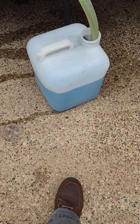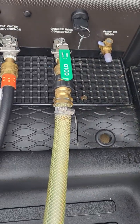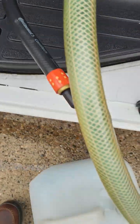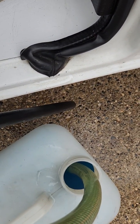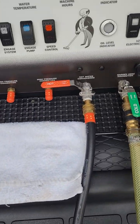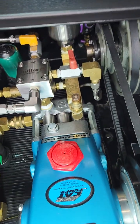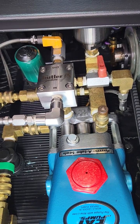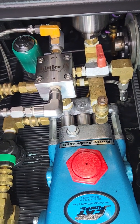I've got almost five gallons of windshield washer fluid here. I've got my hose coming out going to the garden hose inlet, and then with the hot water convenience valve coming out and laying alongside the jug right now, because there is just fresh water in there. I'll show you how to do the proper bleeding of the chemical injection pump — whether you have the square style like I have, the stainless steel round one, or the old style brass ones — with the bleeder valve attached, the process is exactly the same.